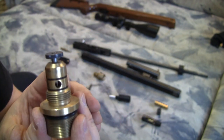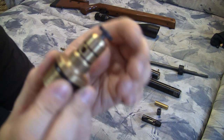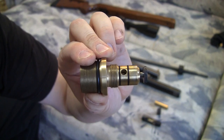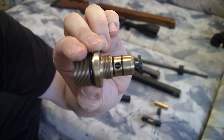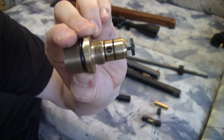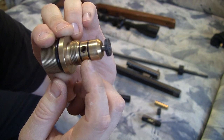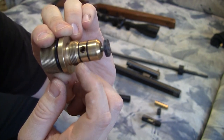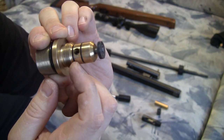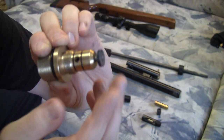And I only made one hole from where it goes to the transfer port. It doesn't want to focus. Just a second. It's a little better now. Okay. So only one hole, and the dimension is exactly the same as the transfer port, so it's 6 millimeter. And also I put O-rings right beside this hole, and not here, because I also don't want any air to go over here. I basically want all the air to go to the transfer port and nowhere else.